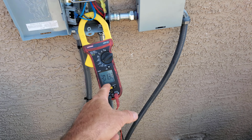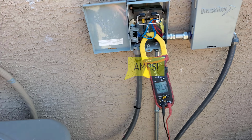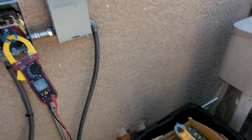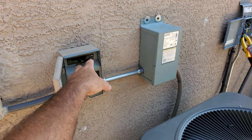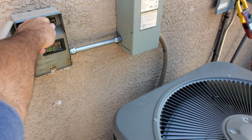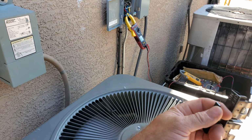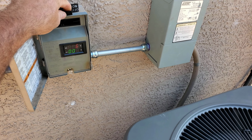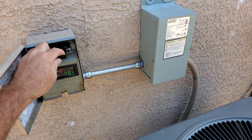This meter I have actually does DC clamp voltage. I didn't even know that. So anyway, utility power is zero, 308 volts. It doesn't really start pulling this till the DC voltage gets down to like the 280s. So even if my DC voltage is like 290 or so, I've noticed that it will not pull anything. Oh, and let me just show you the battery.